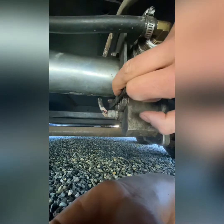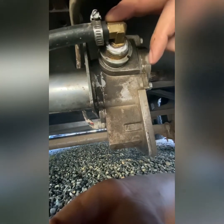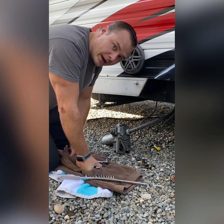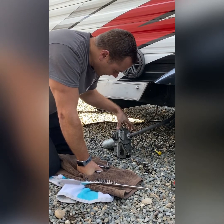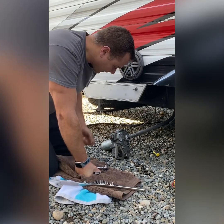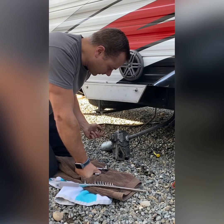Here's the fuel pump — here's the line coming in from the fuel tank and the line going out to the nozzle. It's attached by three screws, so I'm going to take it off, disconnect this hose clamp, and leave the wiring hooked up. I'll cut a zip tie here so I can pull it out and work on it more easily without laying under the RV. Now that we've got the fuel pump out in a better location, here's your fuel strainer — a filter for debris going into the pump. The impellers are behind it, and here is your electrical access. This is the inline from the tank that draws fuel into the pump.